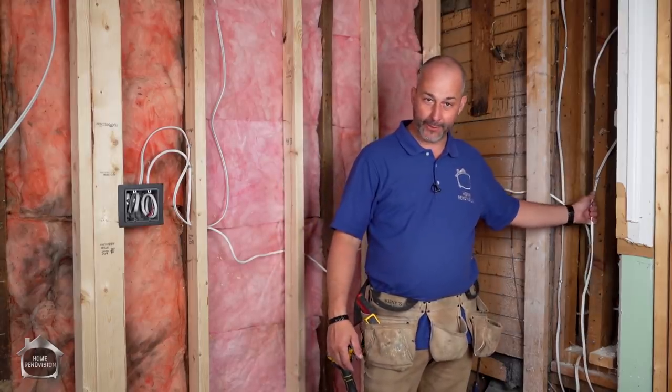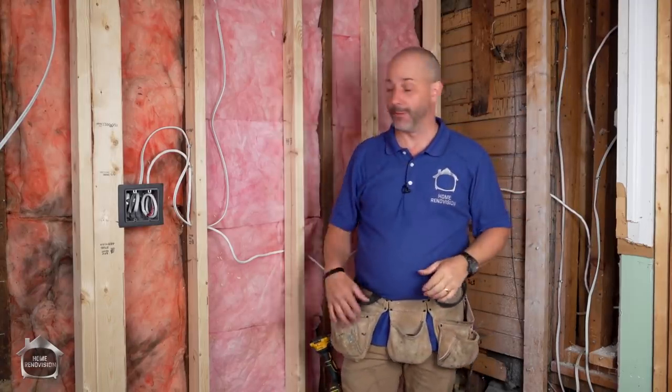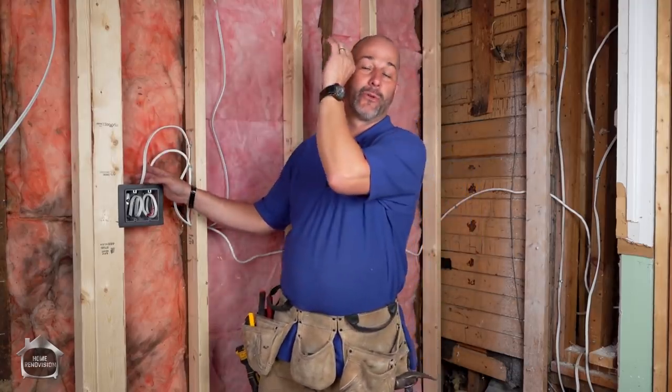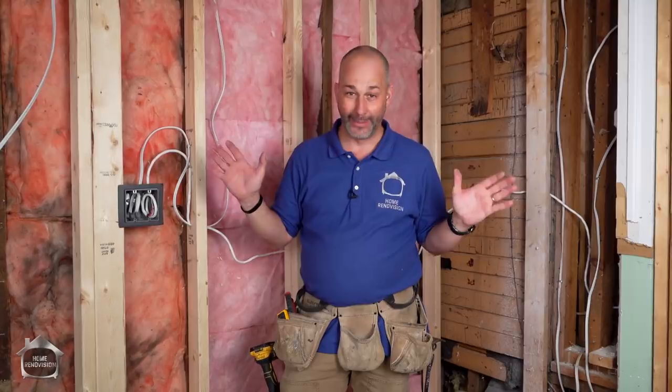Here's just a quick recap: you have your power supply to your first location, which is a two-wire. You bring a three-wire — which is the black, the white, and the red — from one box to the other side of the room to your other box, and then you take your supply line from that box to your fixtures. If you wire it that way, when you go to put on your switches, three-way switch light switches are going to have little black screws, and on those black screws you put the black wire and everything will work out really easy. If you don't put the three-wire in, you're going to run into a whole lot of headache and have to open up the walls all over again.